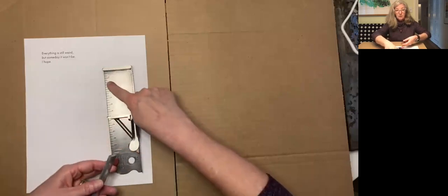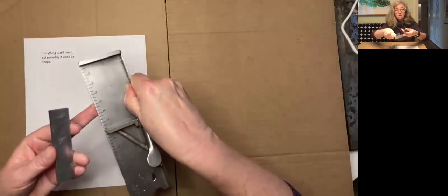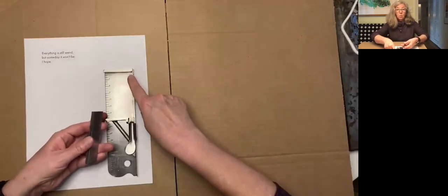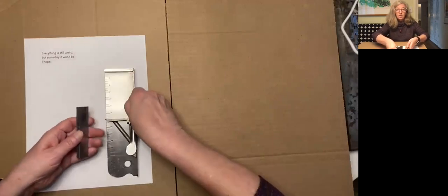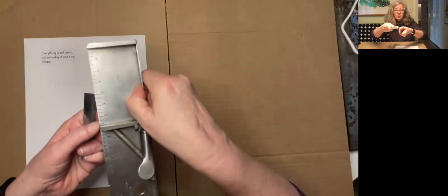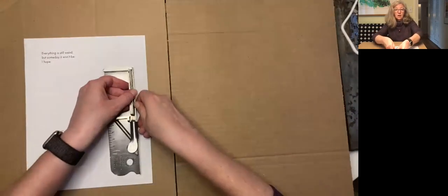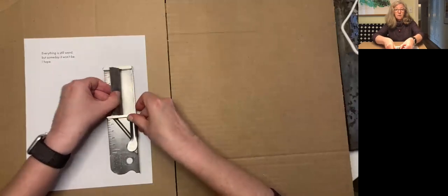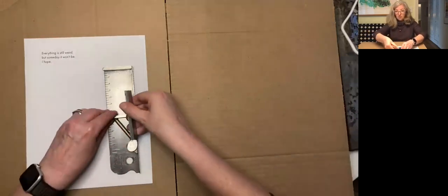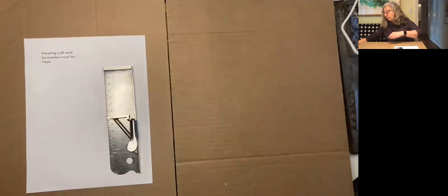So this is picas and points that you see on the composing stick, those are picas. We are going to set on 20 wide. So this is set to 20, you can see that here. This number is 18, 19, 20. And I'm going to use this leading that's going to fit right in here. We'll put them in one at a time. When we get to it, I'll show you, but that's what you need. So you need leading, the job stick, and then you do need spacing.